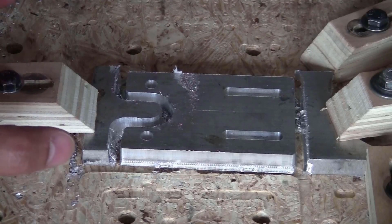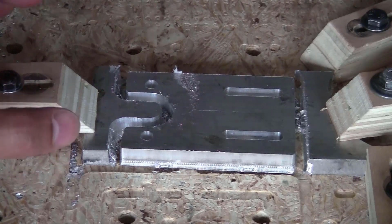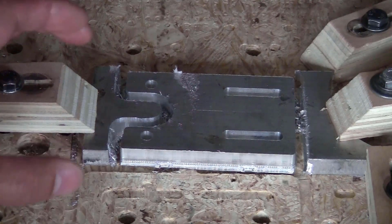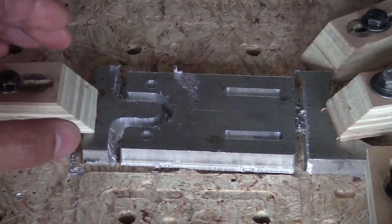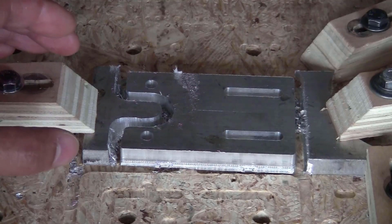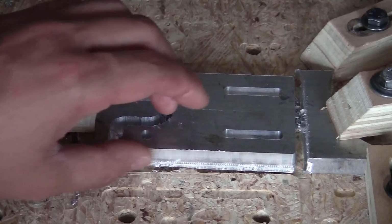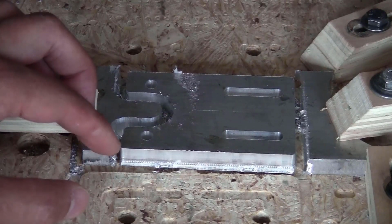As you can see, the piece cuts almost perfectly until the end. When the 2D contour tool pass has a lot of loading, I just push the piece a little bit, just move it away. Luckily the bit didn't break, but overall everything cut beautifully. And on the side here the finish was really nice. You almost have a mirror effect with the 2D contour.